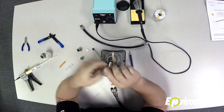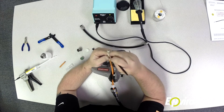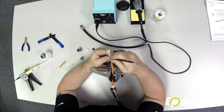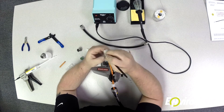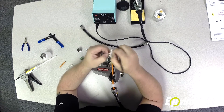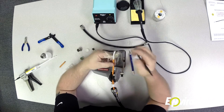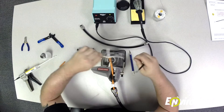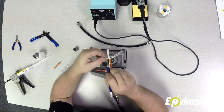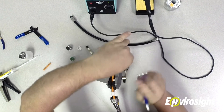Now you have the Kevlar exposed. Take your dental pick and pick at the Kevlar — you'll be able to separate it. It's one of the easiest ways to do it, though it's a little tedious. You don't want to just cut it off at the base — you actually want it to be embedded in the epoxy once you get to the strain relief cup, so you'll have all the strength of the Kevlar. Once you have your Kevlar separated, cut it down to a quarter inch, which is just enough to be inside the cup. You don't need any extra.